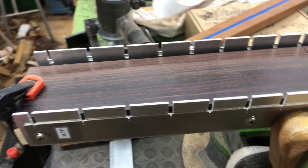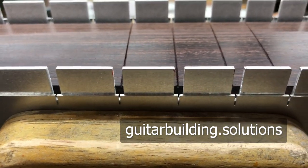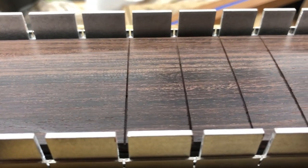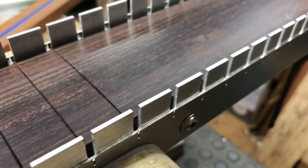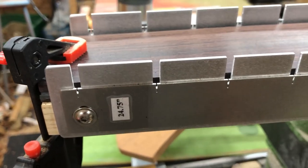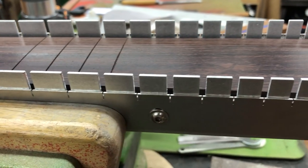This fret-slotting rig has a fat slot and a thin slot. The thin slot gives you the micro-location for the saw blade, and the big slot holds it absolutely flush. You make a mark with your first cut, then loosen the screws and drop the guide rail with the fine slots down out of the way so it's protected for another day. I thoroughly recommend it — I'm not sponsored by them, but credit where credit's due. Nice piece of engineering.